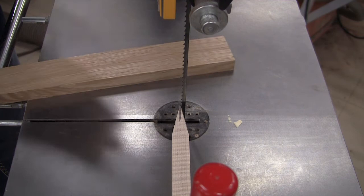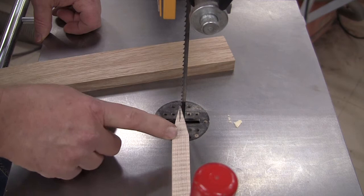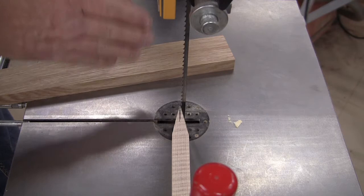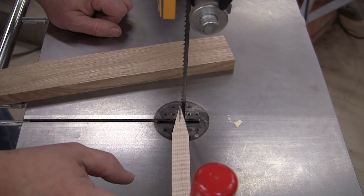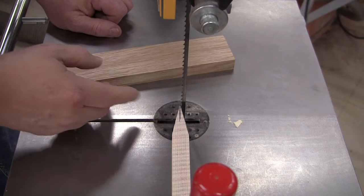Now, as I said, if I was going to use this for resawing, what I would do is take a board that was about as wide as the material I'm resawing, and I would cut that single point out on that wide width, and I would cut it down so that I could still clamp the whole fence to the bandsaw table, but then I would have a guide that runs the entire width of the board